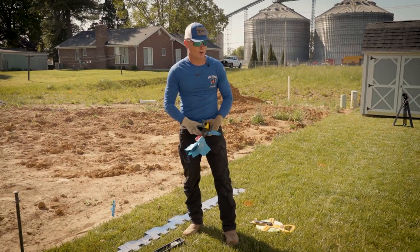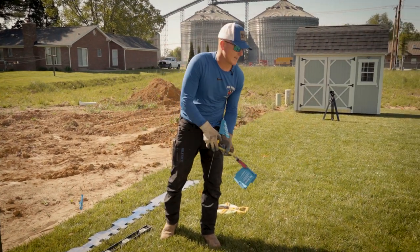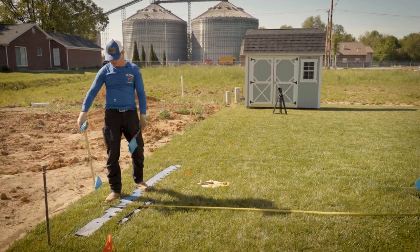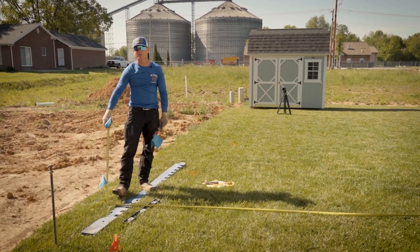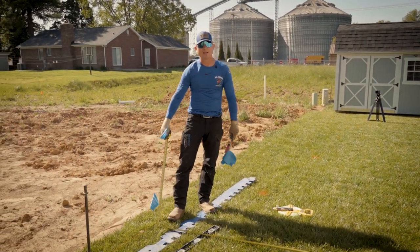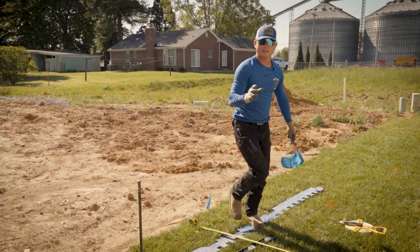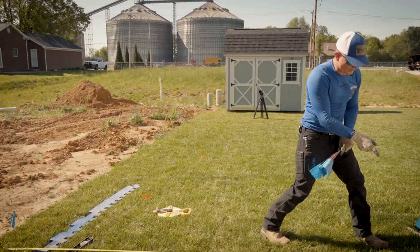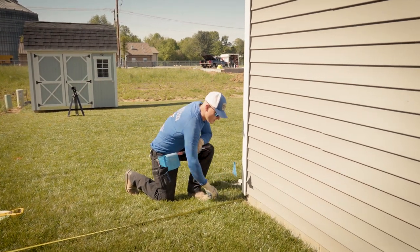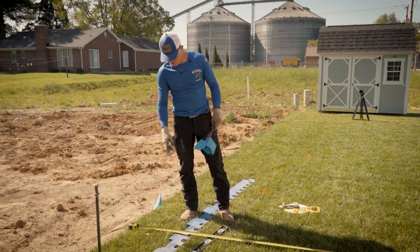There's a gate here as well — it can go in the center or off to the side. The overall dimension is 12 feet, but with aluminum fence at four foot tall we're actually at 10 foot 6 today. Outside of this flag it's 10 foot 8. The gate opening is four foot exactly. I can gain some inches coming away from the house a couple of inches, trying to get it to where I hit one section and the gate, so right now I'm at 10 foot 6.